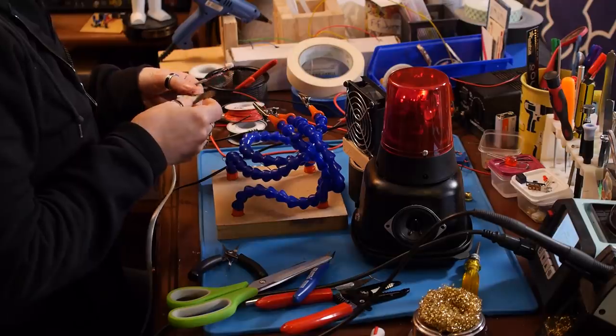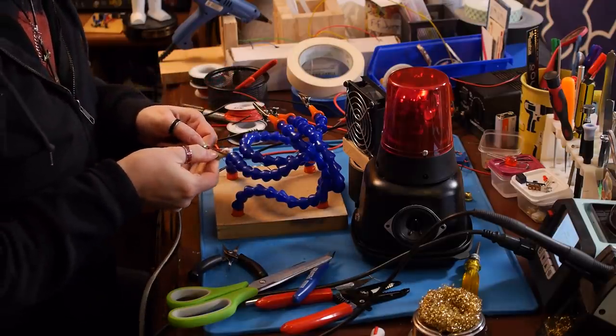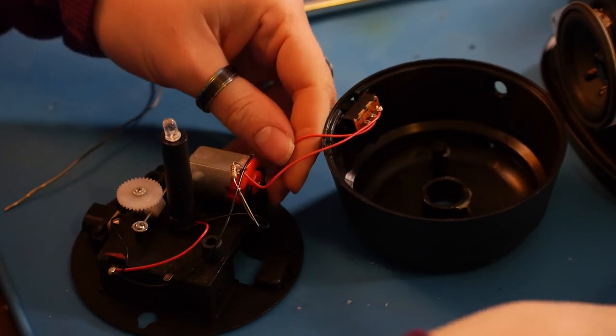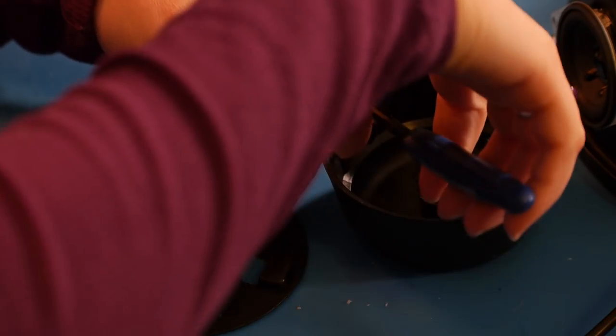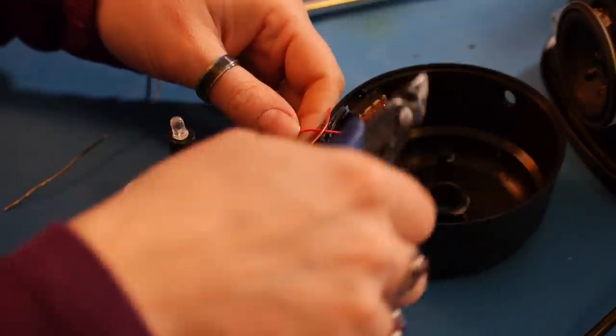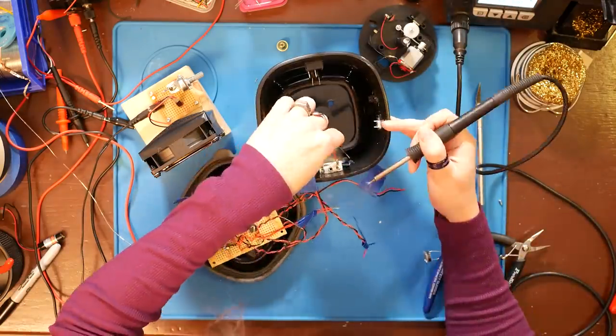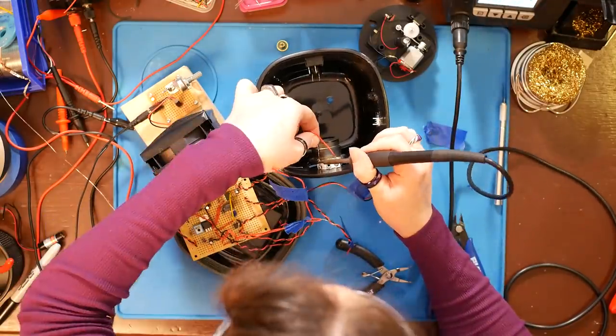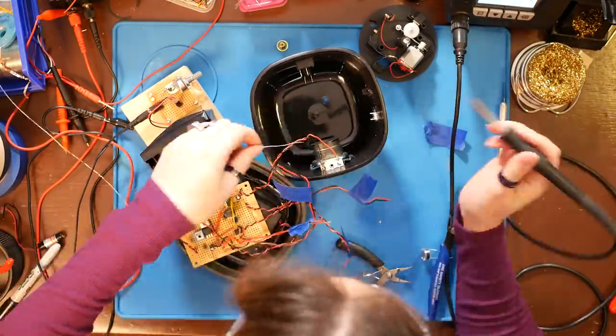I chose two different plugs so there's no confusion as to which gets plugged into which jack on the side of the case. Remember, I'm bypassing the power switch in the beacon and soldering the wires directly to the power terminals. In hindsight, I should have used stranded wire instead of solid core wire so that they were more flexible and would smoosh into the case more easily.